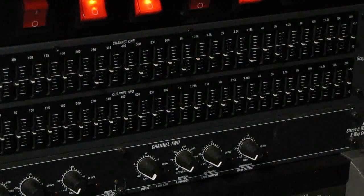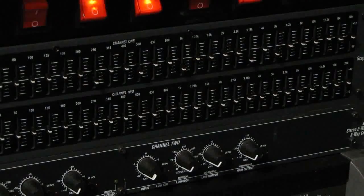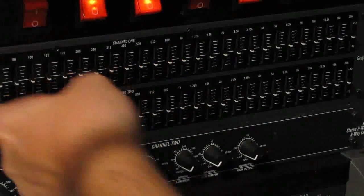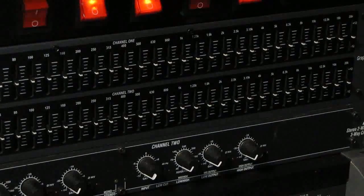If a performer says they can't hear themselves and you've notched out a whole bunch of frequencies, the problem is real — they can't hear themselves because you've cut a lot of the frequencies that are probably within the range of the instrument they're playing. So let's reset these and try the Audix i5. We've reset the frequencies on our EQ and we've got the Audix i5 positioned. We're going to be using the same gain setting on the board as we had for the Sennheiser.